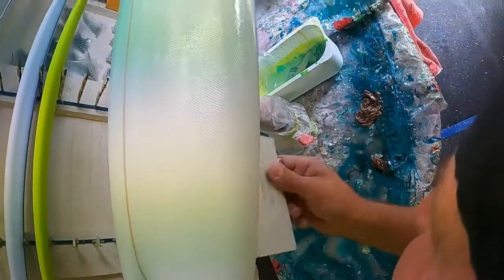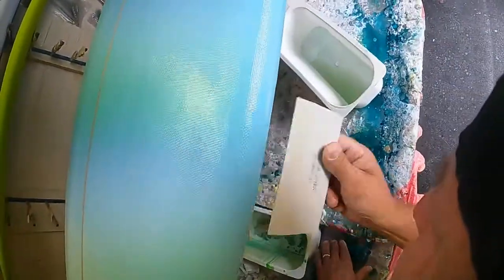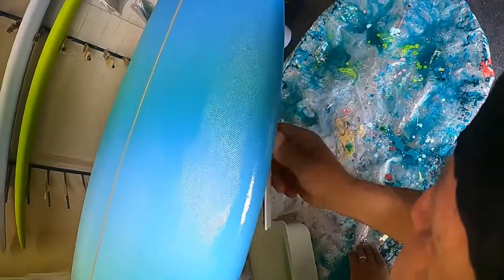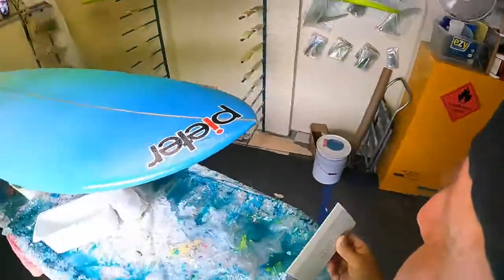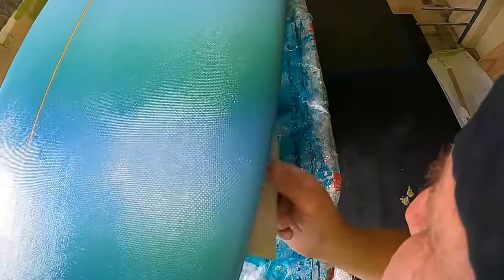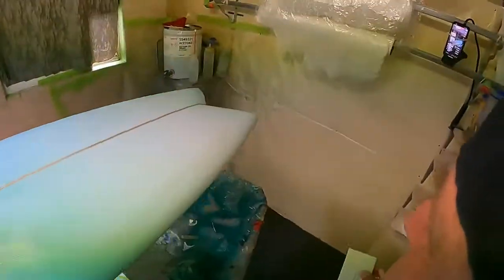Go around here, and then I'll get this piece of cloth, put it on there. And I'm getting all the excess resin off here. Not that it's a lot, but you can hear the sound my squeegee's making. I don't even have to look at it. You hear that? That means it's dry. That means I haven't got too wet a lap. You hear good glassing before you see it. I'm telling you that now. I know that lap is perfect.